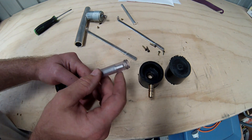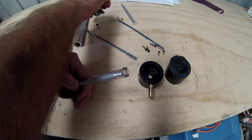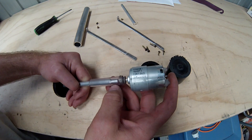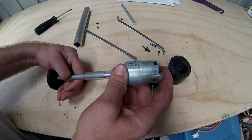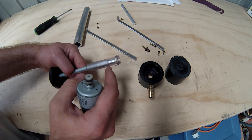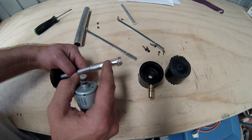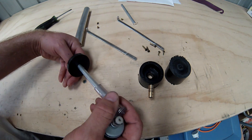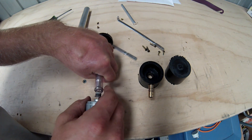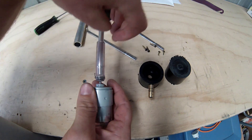On the other end of the pump shaft I have this bit of hose — some sort of flexi drive. That way the motor's not directly connected to the shaft, because if it's out of alignment just a little bit, eventually either the shaft of the motor or the pump shaft will break and crack off just through misalignment. So that little bit of hose does the trick. I just wrapped a bit of wire around there to put a bit of tension on it — it fits around the gear and holds it in place.